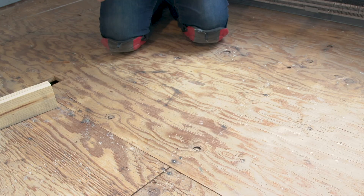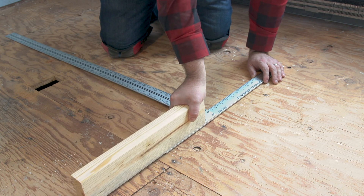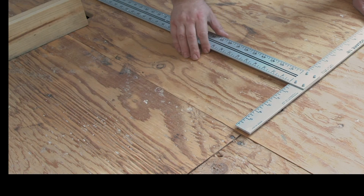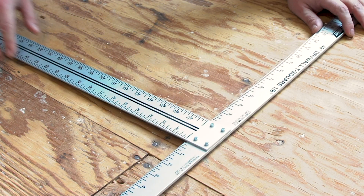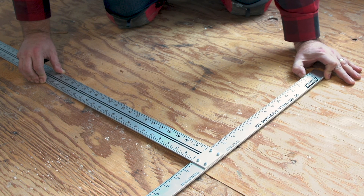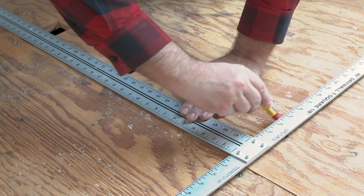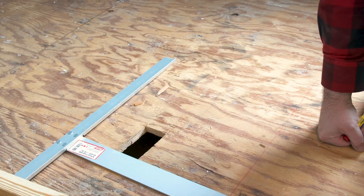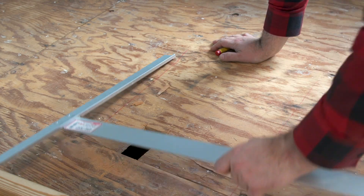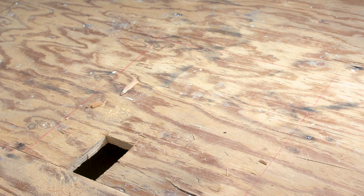To mark the floor I'm going to use this drywall T-square. The reason I'm using this is the top edge is exactly the same width as a 2x4. I can lay this over and you can see the two nails in this joint right here — I can use this to give an idea of where the outside edges are. I'll line this edge up with the long part of the plywood, move just a little off the edge so I don't hit the stud, and mark this line. Then I'll mark off the other side the same way, measure 16 inches, and mark across. Now with the floor marked, it's time to cut it out.